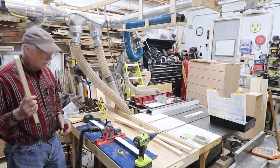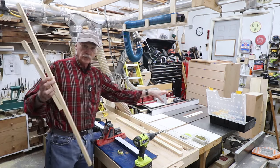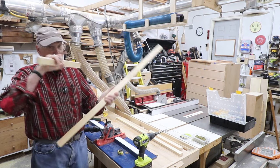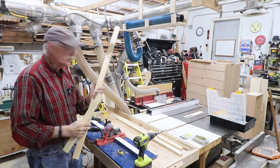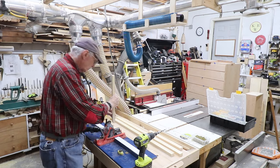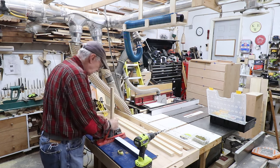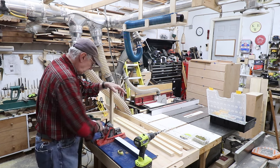Back to the project. I've got the pocket hole jig set up over here instead of on the table saw. I've got my pieces cut for the lower frame — this is one and a half inch wide, and it'll be pocket hole screwed into the base. I need to do pocket holes in the cross pieces, and everything's all set up.